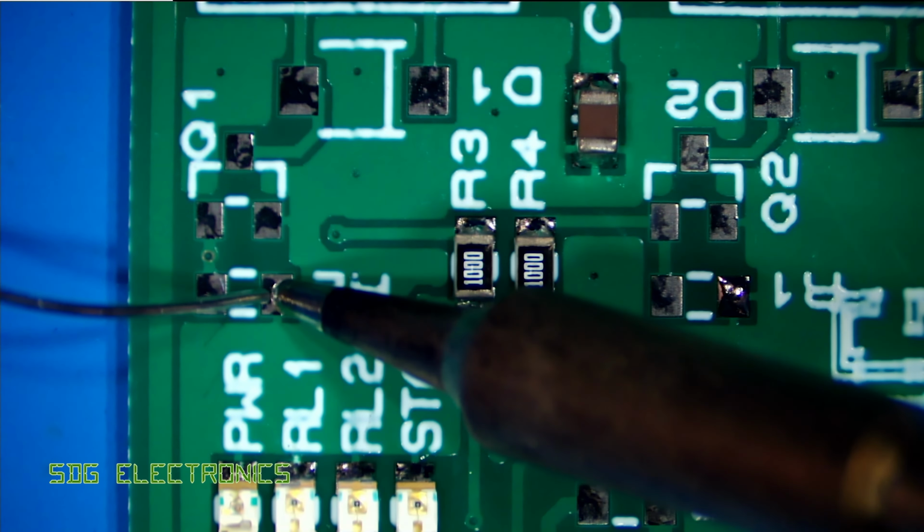So I realised we should probably test the problem that I was talking about earlier, where if you touch something that is connected to earth, it skews the reading. So what I've done is I've plugged in this lead into the back of the unit where the ESD connector is. That's connected straight to mains earth. And we can put it on one of these pads here that's connected to where the crocodile clip is connected. So if I remove this from here,